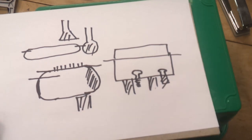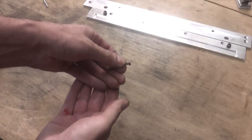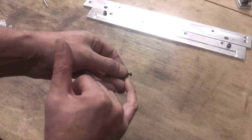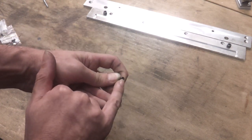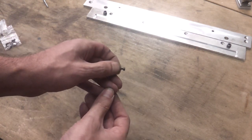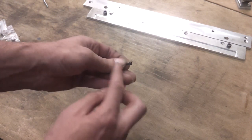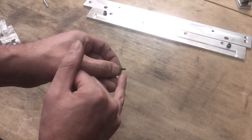There are a couple of other ways of getting around the issue rather than using the waffle pattern or cross pattern ejector pins. My idea is to use a bolt basically as a mushroom pin, because the bolt head has got a mushroom profile on it. I can play around with that on the lathe — maybe chamfer it if it's biting too hard, or turn it down a little bit if there's too much overhang. I've also got the socket on the end which the plastic will mould into, giving a bit more surface area, and I can simply drill holes and embed these bolts into the mould.